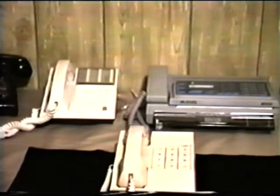Normal touch-tone dialing uses a signaling method of dual-tone multi-frequency tones. This is a method of representing digits by the playing of 2 tones together, using different tones for different digits. For example, the touch-tone digit number 1 on your telephone is composed of a 697 Hz low tone and a 1209 Hz high tone.